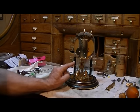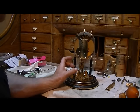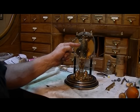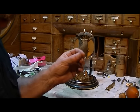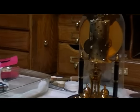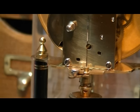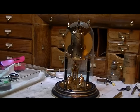Second, this pendulum — you have to be very careful with it. This pendulum is going to be suspended in a cup, not touching anything, suspended in the air by a very thin suspension spring. It's going to be just a little bit thicker than a human hair. That spring is most of the issues with a clock of this kind.